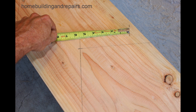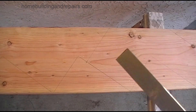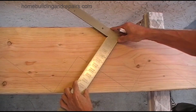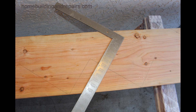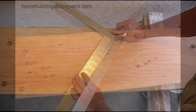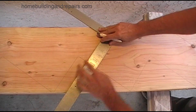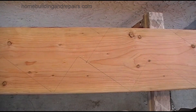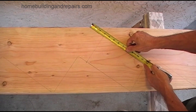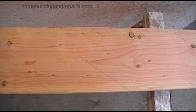Marking something with a joist — five and a half inches, whatever the joist size would be — and then squaring it off without a general understanding of how it's going to be supported again is a concern. Most joist hangers you'd use to support a stair stringer are probably not over two inches wide. In this case it's about three inches, so there will be a section of the stair stringer that wouldn't be supported, and if it cracked there it could severely weaken the stair stringer and create problems.